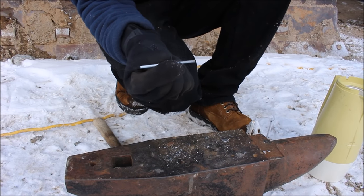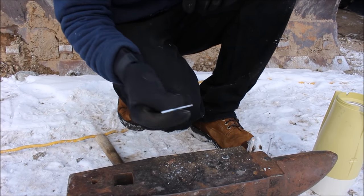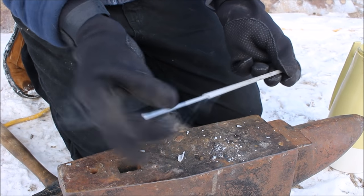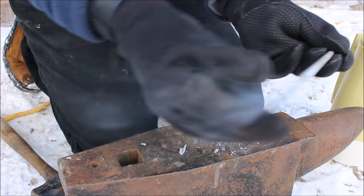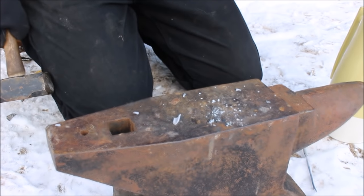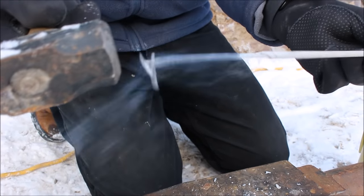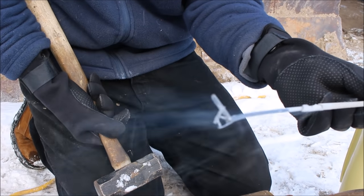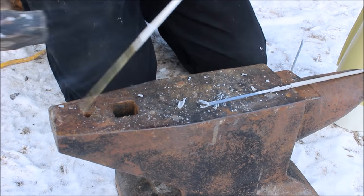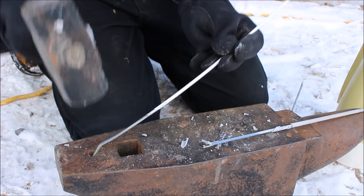This was a piece of aluminum welding rod so the alloy might be a little different from what you've got in your pop cans, but the aluminum sure didn't hold up — it shattered, broken like it was a piece of glass. The 7018 broke too — look at those pieces. But the bronze seemed to do okay — it was able to bend and didn't shatter.